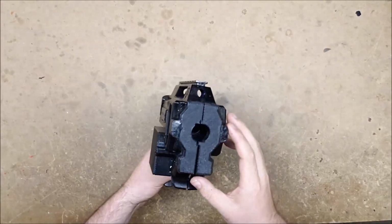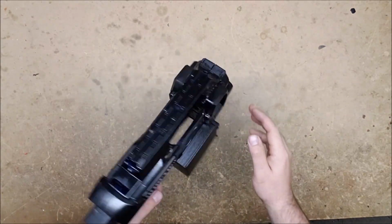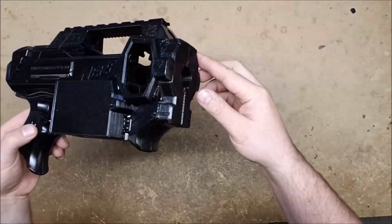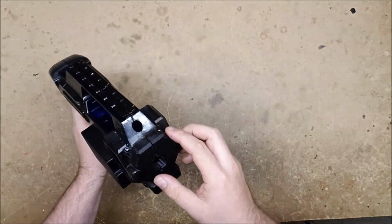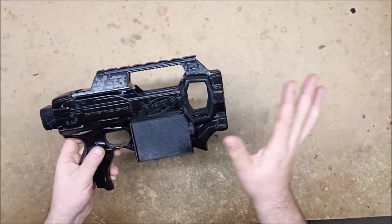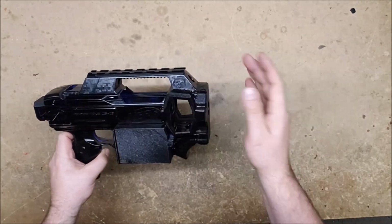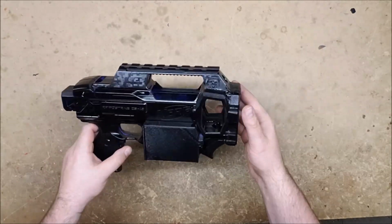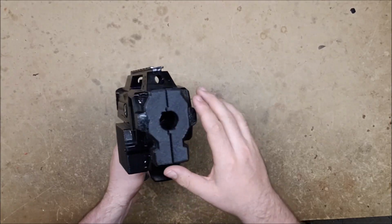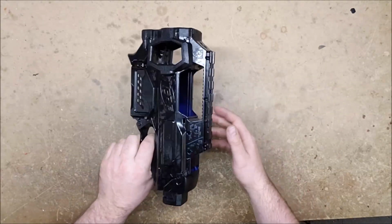Alright, there is still a little bit of painting I still need to do. A couple of little cracks and crannies that I didn't quite get. But you can now see how the cleanup work has been largely made even better by the paint. And this is vinyl dye, so it really puts a really thin layer because it actually soaks into the plastic. Once I start doing the detailing paint, that will add a thicker layer, and that'll cover up even more of some of the scratches and stuff that have been left behind. But all of the gaps have been filled, and it is much smoother and much nicer than it was before.